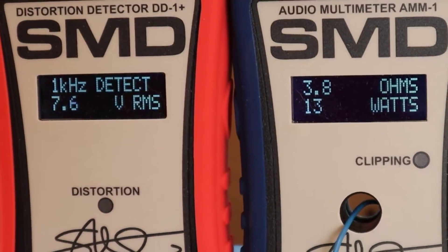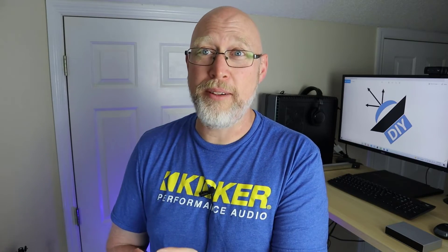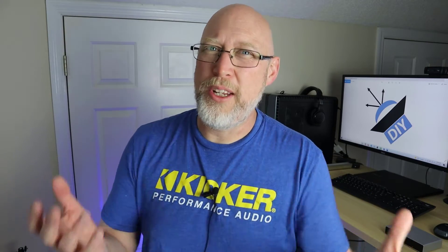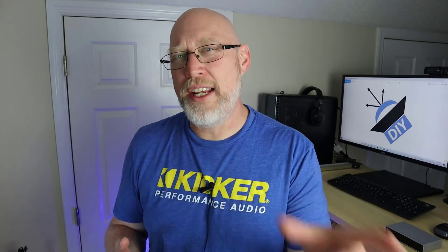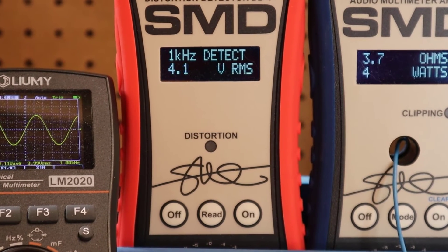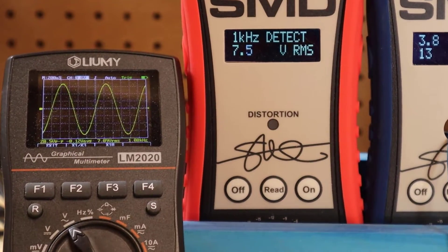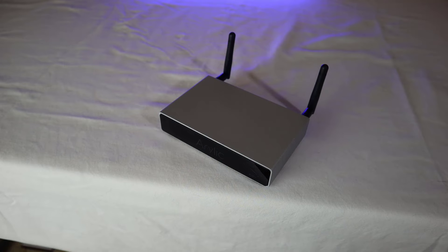Okay, that's all the way up, and that's 13 watts. What you're going to notice is we never hit distortion or clipping. So something else is going on here — we need to investigate a little bit. Let's try it again with the oscilloscope hooked up. With the scope hooked up, we got a nice clean wave. We still got the same result — only 13 watts. I'm really happy to see that nice clean wave because a lot of these little Class D amplifiers will have some interference from their high frequency switching and you'll see it on the wave.